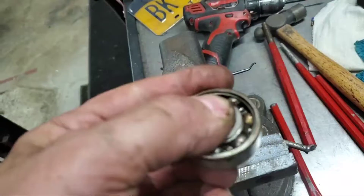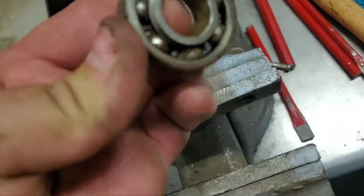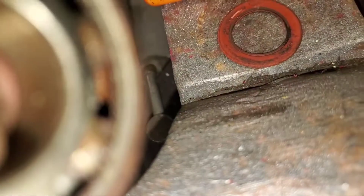It doesn't even want to turn right. Yeah, there's rust all over — you can see it. The bearings — that's where all the noise was coming from. Water got in there and it's all rusted, and that's what that grumbling noise was that transferred through the rest of the machine.